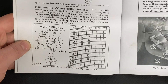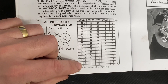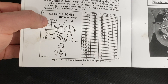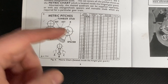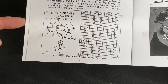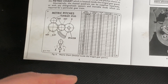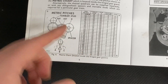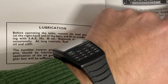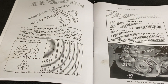The other things the table specifies to achieve the required feed per revolution — which is the thread pitch — include the tumbler stud position, the selector position, and the lever position. The lever positions are A, B, and C, and the selector position moves along the gearbox. I'll show you what I mean on the machine now.